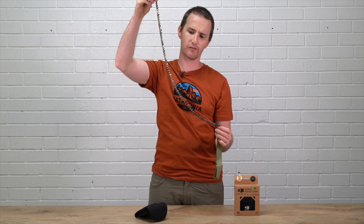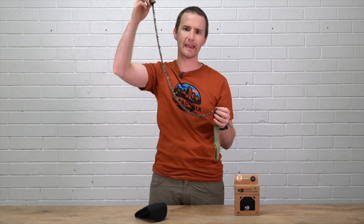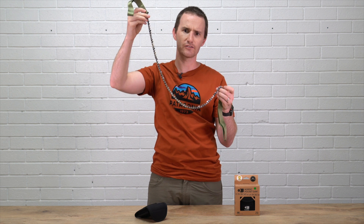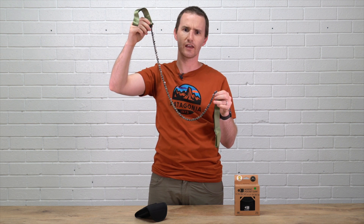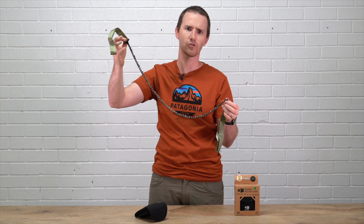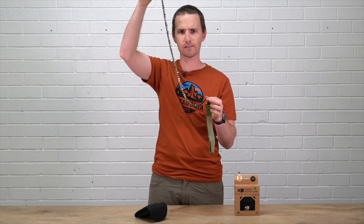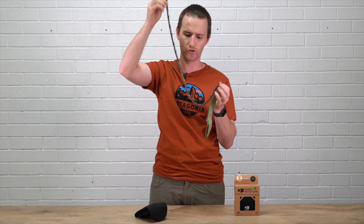There's a tooth every single chain link — that's something we don't see on a lot of other pocket saws. Typically what we see is one sawtooth and then a whole bunch of blank links. The problem with that, especially with Australian hardwood, is you've got to have massive shoulders to drive the chain. The general rule of thumb for bandsaws is you've got to have three teeth in contact with whatever you're cutting. If there are big gaps, it won't be in contact — that's fine on a chainsaw spinning at hundreds of RPM, but if you're powering it by hand you just can't do it. So having teeth alternating all the way down the chain is really, really good.